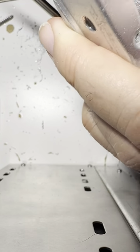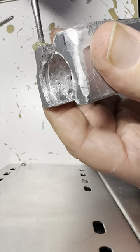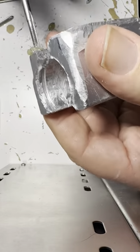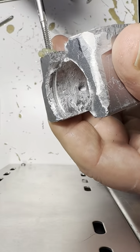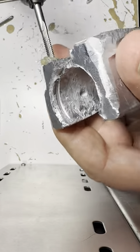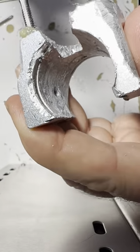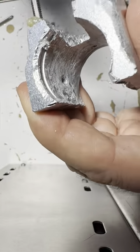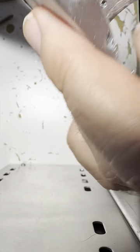Yeah, it looks fine. You can see the shavings coming out of there, forward and back, forward and back. When you go back, it takes the shavings and kind of takes them down the rim of this tap, I'm sorry, not die. All right, so I really want to make sure this tap is going to come out. Looks like it is pushing out some debris there. I want to make sure it comes out the top and doesn't strip because it can't go any further. Oh, yeah, it's coming through. So, yeah, we got it.